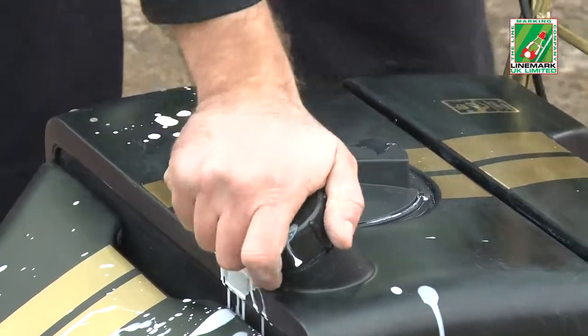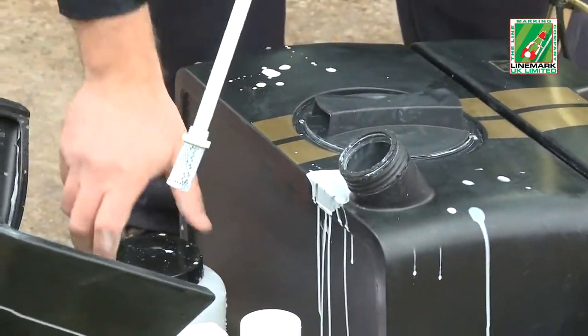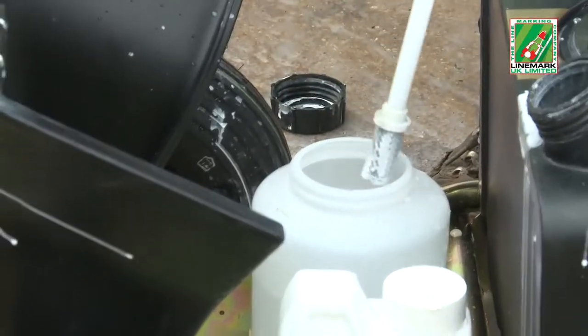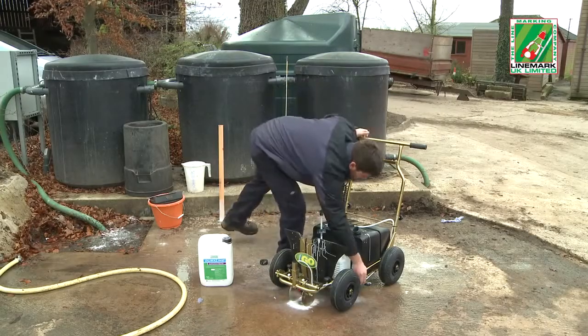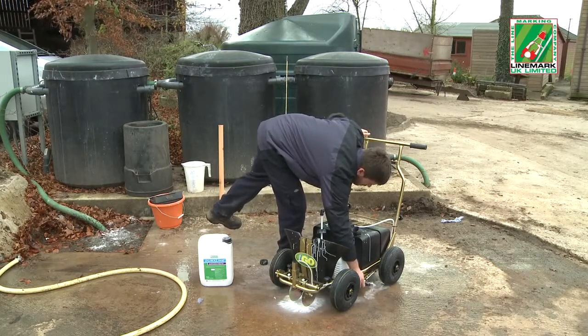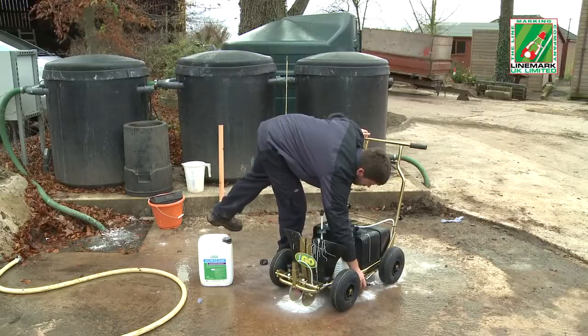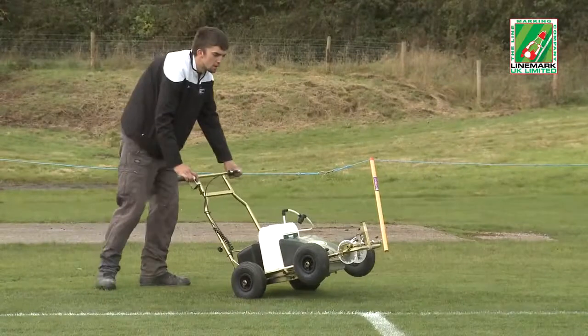Using the Argo machine for comparative purposes, the front machine cover is lifted to reveal the priming bottle into which the paint transfer tube is inserted. The procedure for making the machine ready to apply paint is the same as with the Impact paint. The pump will first expel the water in the pipeline, and when paint emerges, the on-off button is pressed to stop paint flow. The line marking operation can now begin.